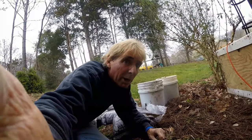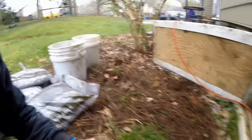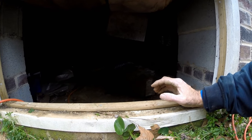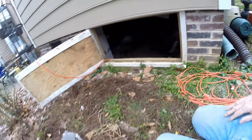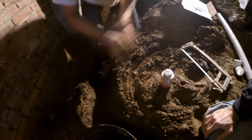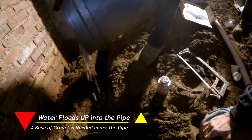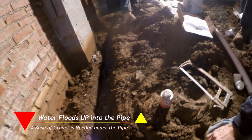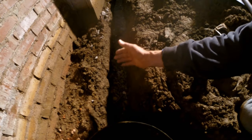Bringing the gravel back in here is the hardest part of this whole job. We've got gravel out here — by the bag and in buckets in the trailer. There are actually two crawl space doors since an addition was put on, so once we get into the main crawl space it's quite large. We're putting a little base of gravel in the trench — just a couple inches — all the way back through the footer tile so that the perforated pipe sits on the gravel. What happens is the water floods from the bottom of the trench through the gravel up into the pipe, and then it's carried away to the pit.